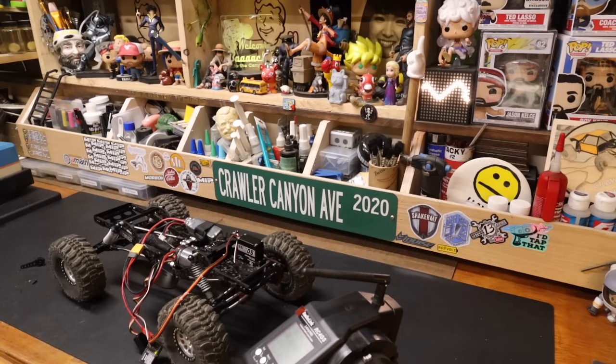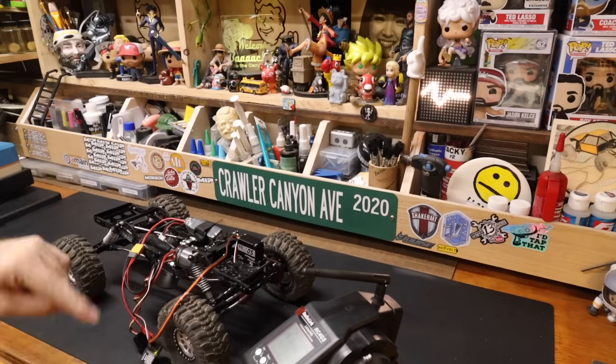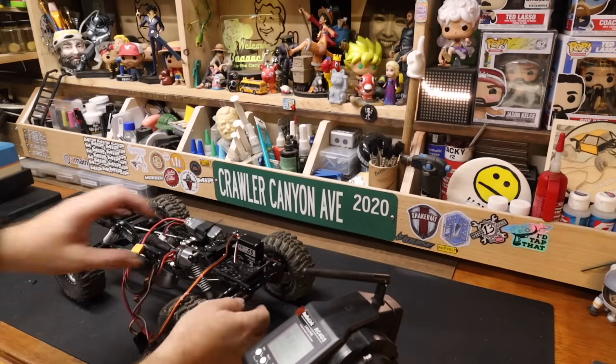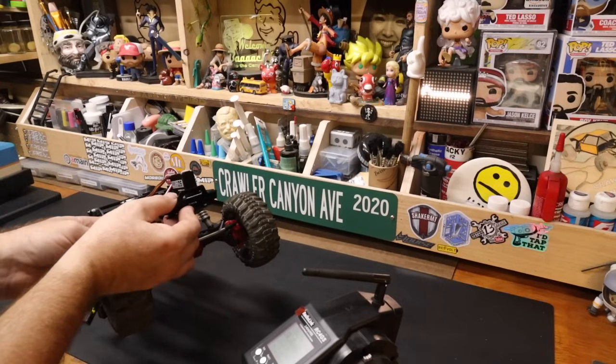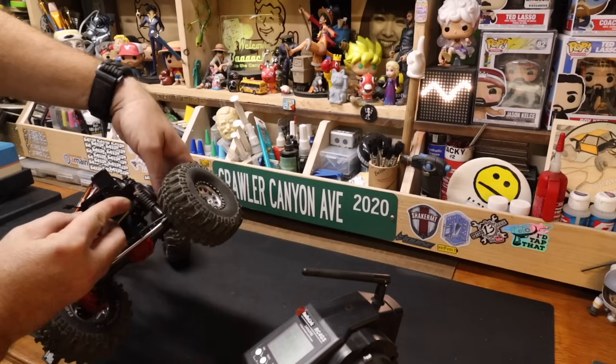Now, on the rock, that might not be explicitly negative because the front is going to try to rise. So if we go into the rock over-drooped in the front, it's not grotesque. The rear angle looks fantastic. It's not bad. There's just the part of me that is like, you should change that. So for right now, we'll do it the easiest possible way. We'll put about 7, maybe 8 millimeters of preload in there.